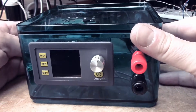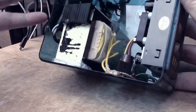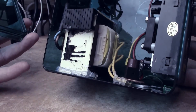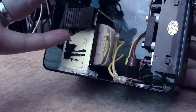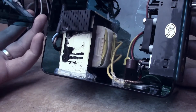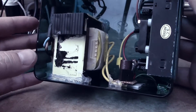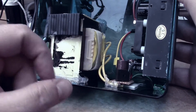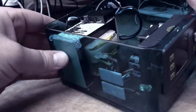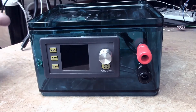What I've done is I've taken it and built it into this box here. I got this box from Robert Dyas — it's a sandwich box in fact. I've got an old 21-volt transformer which was rescued from some piece of equipment I was taking apart. I made a little bridge rectifier smoother and just mounted it all in a box with a little power supply switch, and it makes quite a nice little bench power supply.